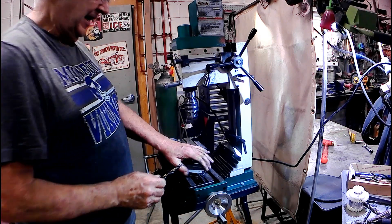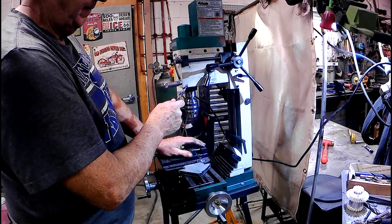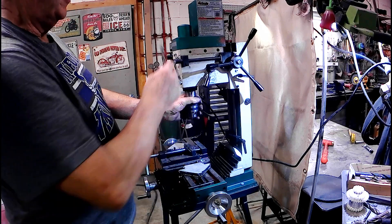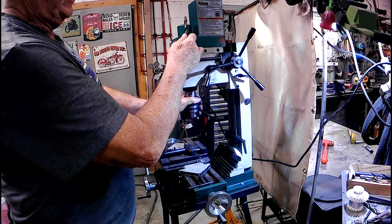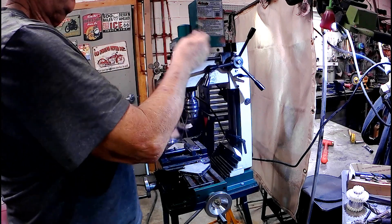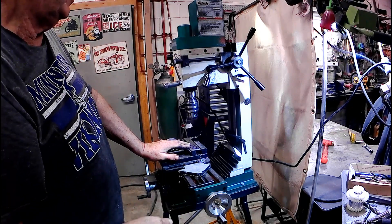I'm sure the other machines like this also have plastic gears. When I called them about it, the guy said they put plastic gears in on purpose as sacrificial gears — if you stop the chuck, it breaks those instead of wrecking something more important. Now there is a plastic gear between the motor and the main drive, and that one is fine to be plastic because there are two bolts to pull out, six for the housing, you slip the new gear in and you're back going in about 10-15 minutes.